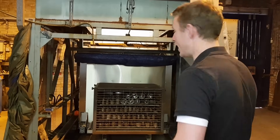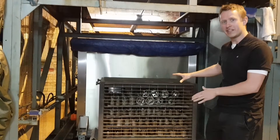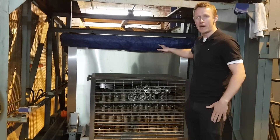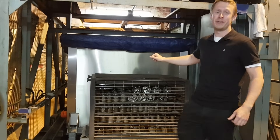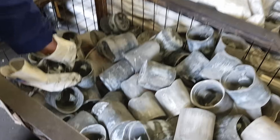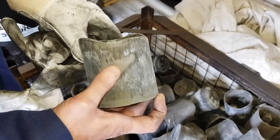We're at the heat treating plant now — you'll see we get roughly about 500 pistons in there of different shapes and sizes, heated up to near the melting point of the aluminium and then quenched in the tank at the back, which is absolutely key for making a strong forged piston. The pistons go through a bespoke heat treatment process, and then they'll need re-blasting and trimming off any excess material before the machining process begins.